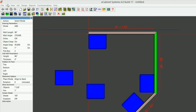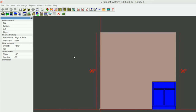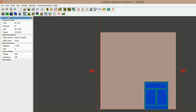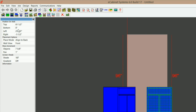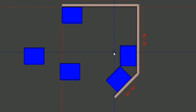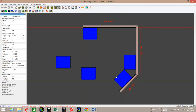I'm going to go back into eCabinets and click on this wall. Under elevation, I'm going to do basically the same thing as before — click on my cabinet, and I'm going to go from 0 to 9 and 15/16. Then go back into overhead view and you can see how that moves. I'm going to do the same thing with this one: click on view, go to the left 9 and 15/16. And that works. Let's see what we look like — I'll zoom in and see how close we are. That looks pretty good right there. So we got those aligned.